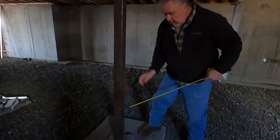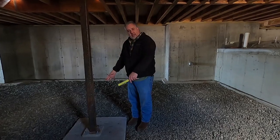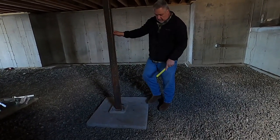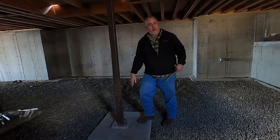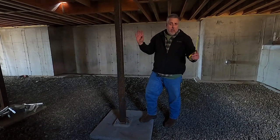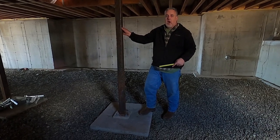All the load coming in goes down into the column, which spreads out to a wider footing. Think of it like our bodies — we're a column but we go down to some pretty big feet, in my case size 14. This is basically the feet of the house: we take all that load, bring it down, and spread it across. Inside this concrete — about 12 inches — there's a series of reinforcing so we don't get what's called puncture shear, where the column simply pushes through the footing. The footing needs to be strong enough to push back on the column and support the weight — that's the reaction, if you're looking for the correct structural term.